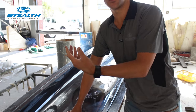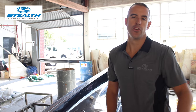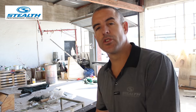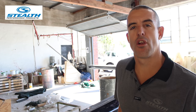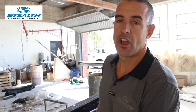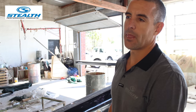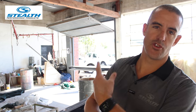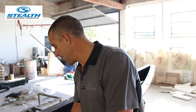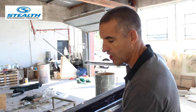Using the mould — in this case the bottom mould of a kayak — we will manufacture a fiberglass kayak to reproduce a finished kayak. The first process using the mould is spraying the colours of the gel coat. A lot of people think we make a kayak like a car, spraying the paint last, but in actual fact the mould will have its colours sprayed on first. Everything we do in this mould is reproduced in reverse — a mirror image. So for a white kayak, we will spray a white gel coat onto the mould.